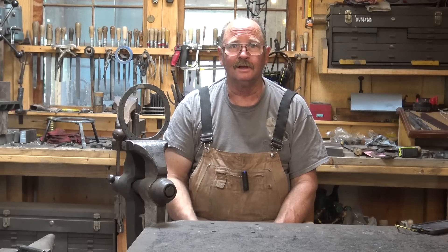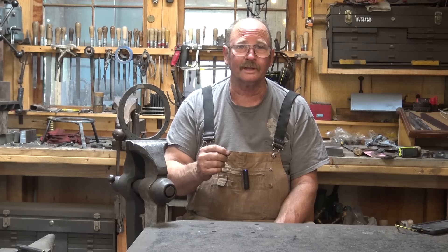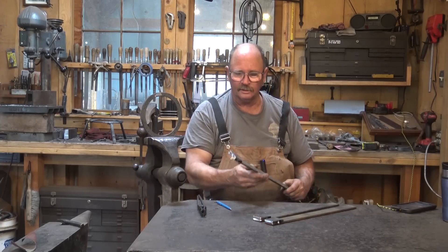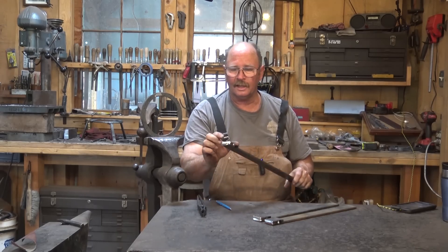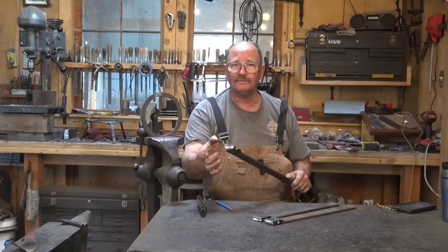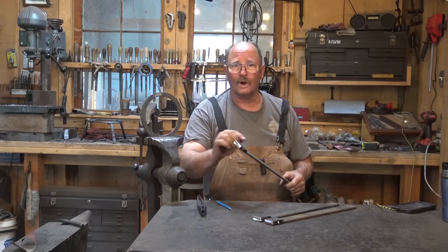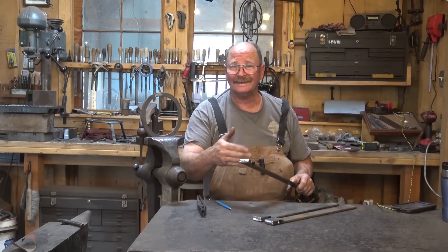But how much is enough? I thought I would do a simple little experiment today just to see how far flux really flows inside of a sealed joint for a forge weld. I have prepared three sections of quarter by one and a half flat bar and I've welded a two inch long piece to the end — just a little tack weld on each end to hold the pieces together. I'm going to put flux on a little differently for each of them, then grind off the tack welds after they cool, separate them, and see how far the flux actually gets into the joint.